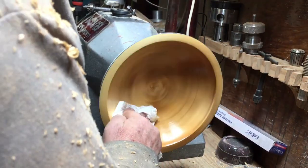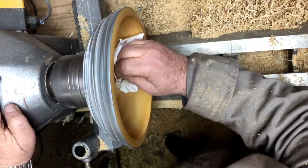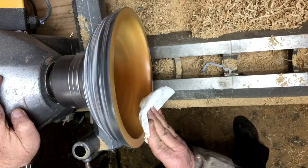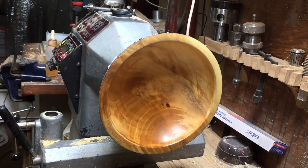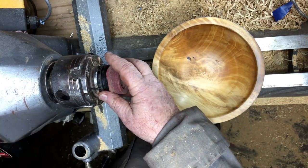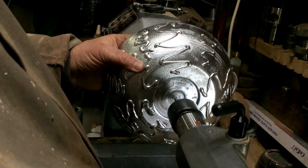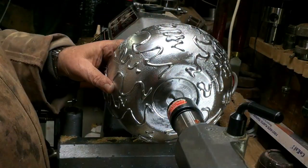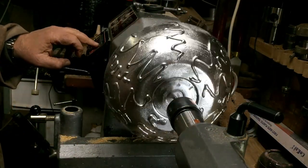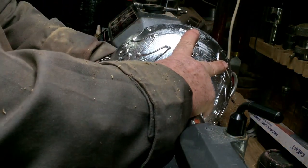Actually this yellow wood came out with a nice little pattern on the inside — I quite like it for the inside of the bowl. The reason I'm putting beeswax is so that if I decide to put a little fruit in it, it'll be fine as a fruit bowl. The red piece is silicon — I created it so I can put a little bit of pressure without damaging the inside of the bowl. It won't leave marks and will be strong enough to turn the bowl around.